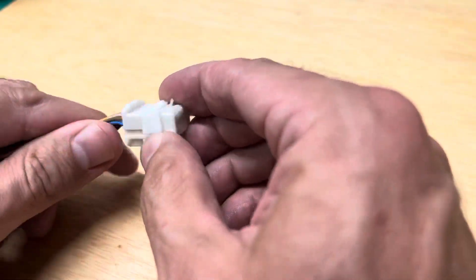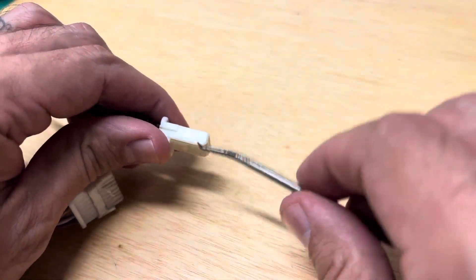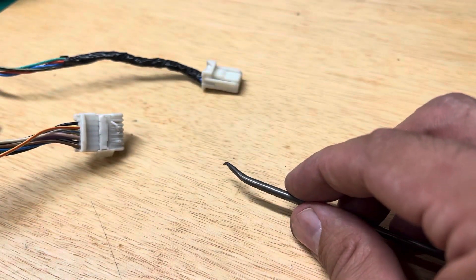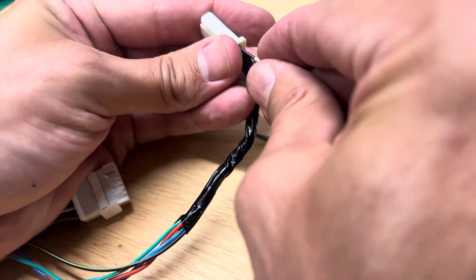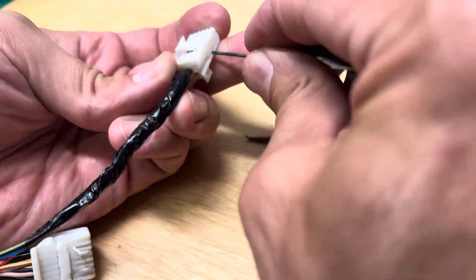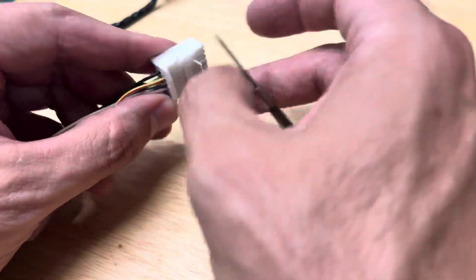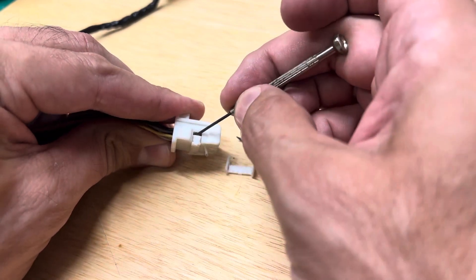This one's been damaged, but to show you how to pull the lever up to unlock the pins, I'll use it on the smaller one. It's kind of hard to see, but there's a bar here and a flap there and a flap there. You can take either a little pick, a drill, or screwdriver and carefully pry the flaps out. There's a little locking hook so you can pry it up like that. Grab it on this other side, pop it up — on this one they come out completely, but on this one it'll just pull a little bit out like that.